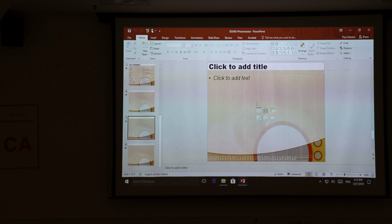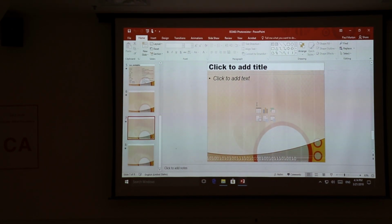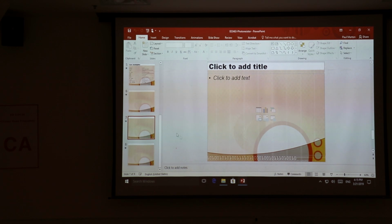So you realize you can't get a reading out of it unless you put it in a bridge configuration, or rather a divider relationship here. You must have this other resistor for it to work. Otherwise, if you took this out, you'd always read ground at that point, right? So it wouldn't help. Or you could connect that to VCC, you'd always read VCC. It wouldn't matter how much brightness. So you have to actually have it draw current and have a second resistor and read the divider point. It's the only way to do it. You can pick a different fixed resistor to give you a slightly different range. That's absolutely true. But you must have something there, otherwise you won't read anything.